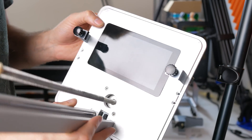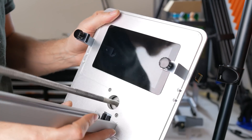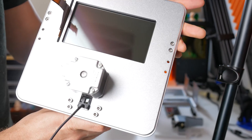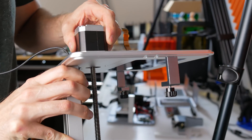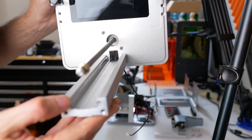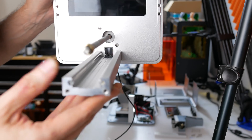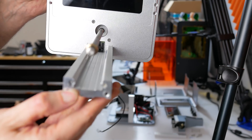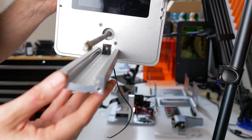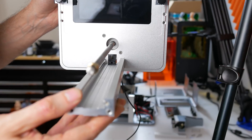They're like a standard 2K resolution. They must have come off of a tablet or a phone or something — I can't imagine they were custom fabbed for these and just everyone used the exact same one. It's a decent stepper motor, pretty standard as well. And of course, the Z-rail. That's the one thing I'll always complain about with these 3D printers. It's the one moving part in the whole machine, and you'd think they'd opt for a nice solid motion rail — one of the linear bearing ones. But they always put these cheaper aluminum extrusion solutions in there. I guess to be fair, they're not terrible and they last for a while if they're properly tuned from the factory.